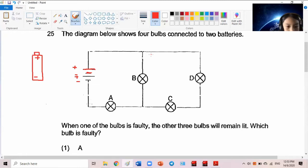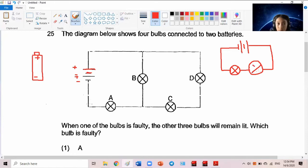How do you recognize a series versus a parallel circuit? A series is when there is only one path — no alternate path. This is a series circuit. If anything is wrong with the path — say this bulb suddenly fuses, breaks — the other one also won't light up. If this bulb is fused, the whole thing never lights up. Or if you break the circuit anywhere, nothing lights up. Do you understand? This is series.